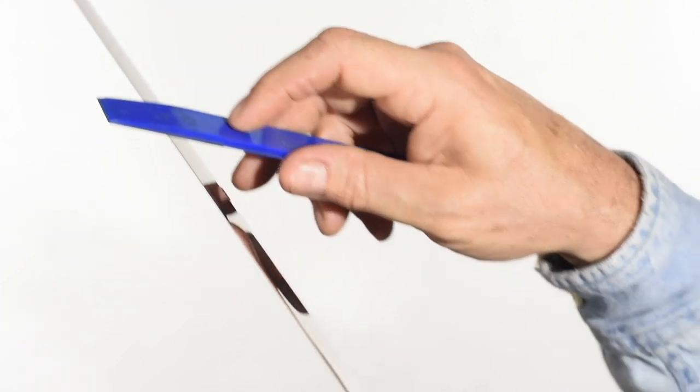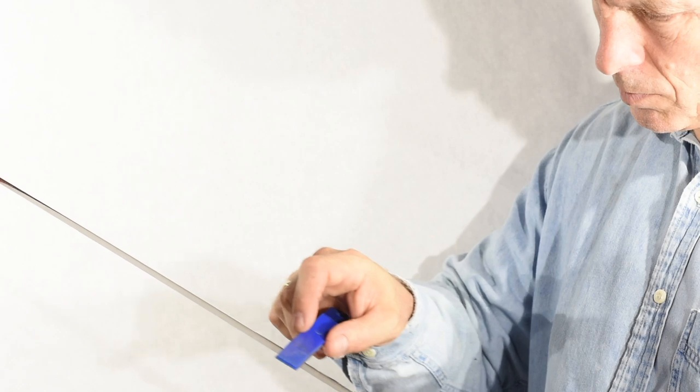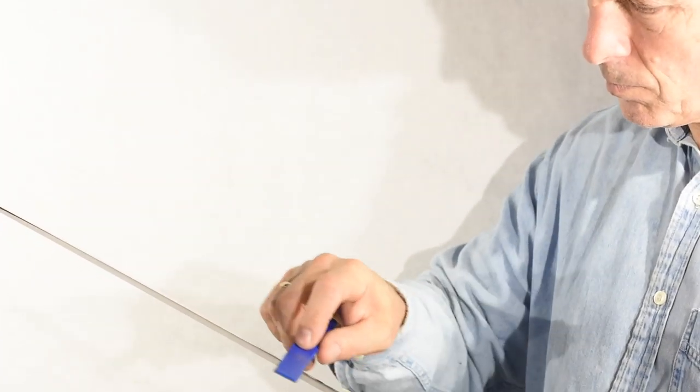On the other hand, if you stick exactly with the angle of the blade as it currently exists — because it's very subtly convex — you'll end up scratching the blade pretty badly. Typically we think about sharpening up towards the spine, but what I'm doing is running it down the edge of the blade parallel to that edge, just a few strokes. Assuming the blade's still reasonably sharp, you can do this amazingly quickly. But what if there's so much wear that just tuning up the edge won't hack it? Unfortunately with Japanese swords, that means it's time for a complete re-polish, which could cost a few thousand dollars if done by a traditional Japanese sword polisher.